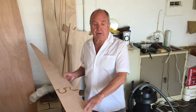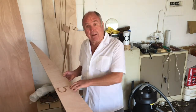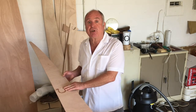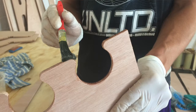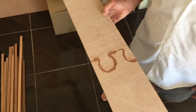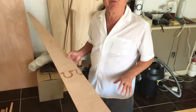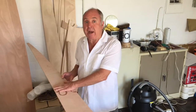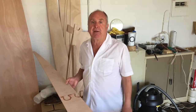The first component we started with was the boards for the hull plates. Here you can see really well cut boards — we saturated both ends with epoxy to make sure we had an exceptionally good fit, and as you can see it's a beautiful piece of cutting that went together rather well. We ensured that we put it down on a flat floor with weights on top — plastic bags filled with stuff — to get these joints really perfect.